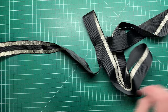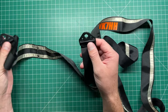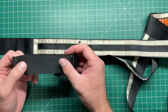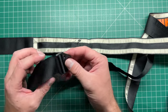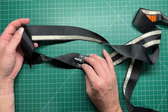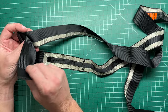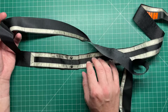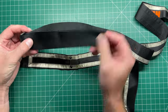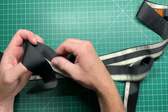Basically you can hang this antenna up from a pole, a tree, or anything like that, and it'll boost your signal on two meters. There are adjustable end straps so you can adjust it for the correct length. If the antenna is slightly off frequency — a little bit long, for instance — you can shorten it. He tunes these for the bottom end of the two meter band, and all you need to do is adjust the strap and pull the tape through to adjust the frequency up and down, which is rather cool.